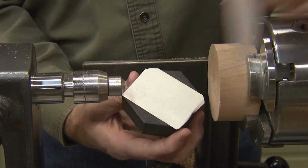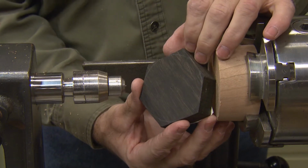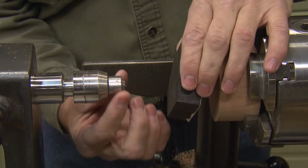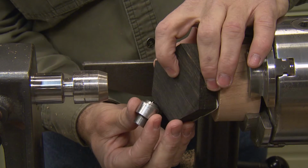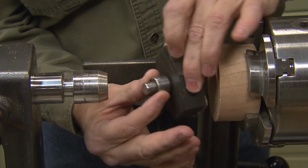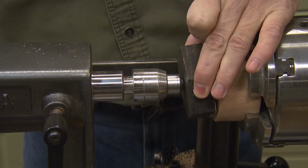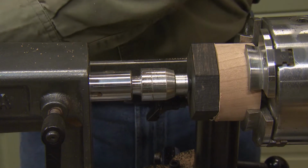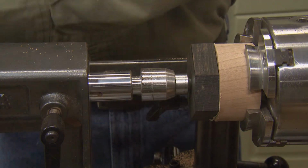Now I'm going to take and pull the back side off of my two-sided tape, but wait a second, if I just push that up there, I've already kind of cut this down to almost the 2.5 inches I need. If I misplace it anywhere along here, when I turn it, I won't have enough wood to make the disc I need to make. So one neat thing is I have a magnetic tip in my live center, and I have my compass point that I use to draw out the circle on the wood before I took it to the bandsaw. And I can take this point, feel around, it drops into that hole. So now I'm centered. We'll bring the tailstock up a little bit further, lock it down, and then I'll crank this in, and I'm going to be perfectly centered on that blank, and I'm not going to waste any of that precious ebony. And now, even though this isn't glue, I'm going to let this hold for about 1 minute to 2 minutes, and it'll make a much stronger bond with that glue block.